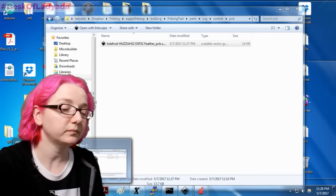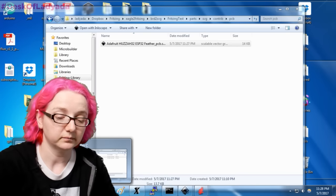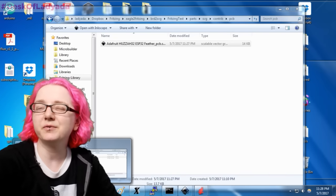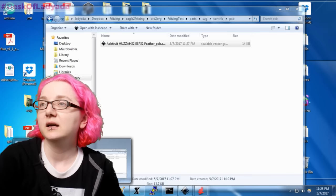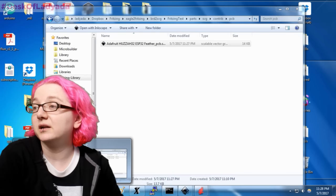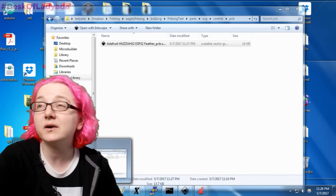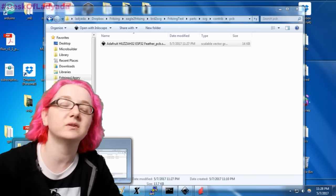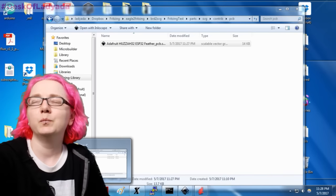How many Feathers could you stack, given power requirements and using one source? It depends. Again, it is a power requirement thing. All the Feathers, you have a 500 milliamp power supply. But if you're stacking LEDs and I2C things, and they're all using different addresses, and there are no pin conflicts, you can stack as many as you want. Most of them are I2C, so they will have address conflicts, but if you have different I2C ones, you should be good. But the idea was not to have to stack more than three.